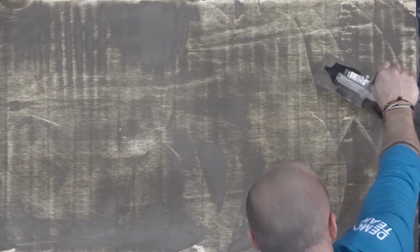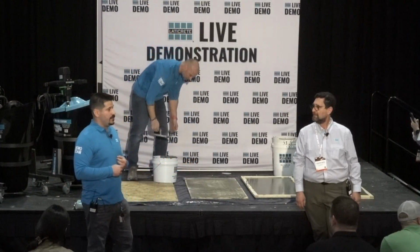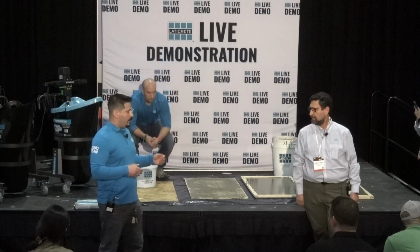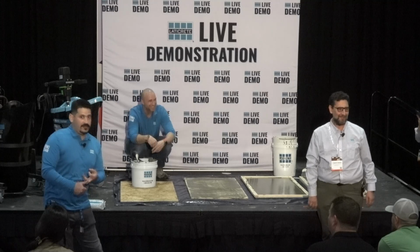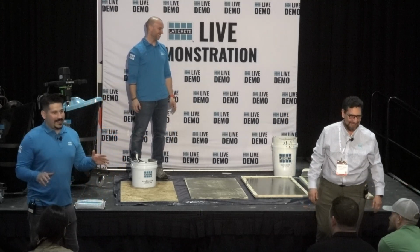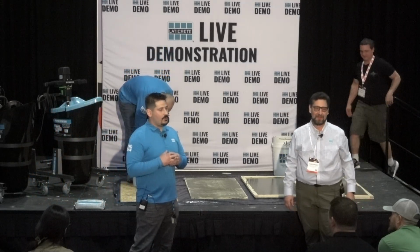A lot of people are smoothing out before they put a moisture barrier down because it's very costly to have the waste moisture epoxy moisture mitigation going down cracks, filling in divots. So a lot of people are applying Skim Lite before. It's fiber reinforced. It can go up to 1 inch. Caster wheel safe. It's fiber reinforced. So many things that I actually sometimes even forget about how many features it literally has. So it's a great all-around product.